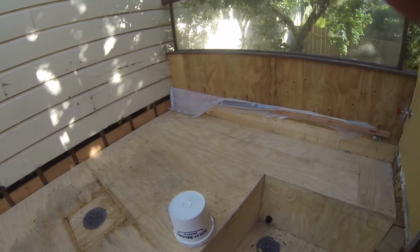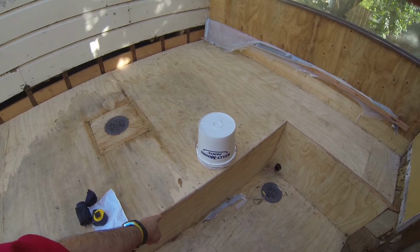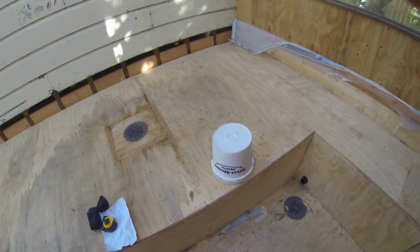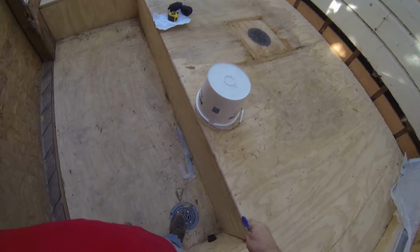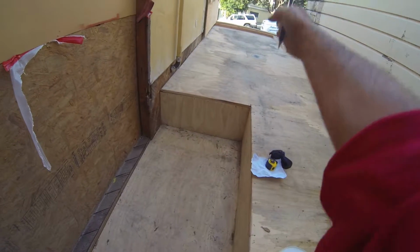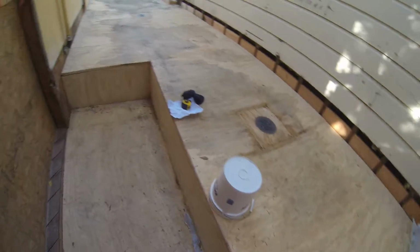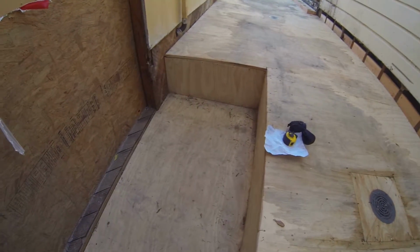So let's go through the details of what's going to happen from this wall here to this right here. You're about 5 feet, so you can come up there 4 or 5 inches, and you can come down this wall 4 or 5 inches. And I think the most intelligent way to do this is to use this line of this opening here as the layout for the piece of Duradek, and I take one 27 foot piece, go from this wall straight down there, lay it. I would situate it so you're lined up with this wall.